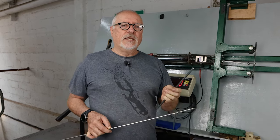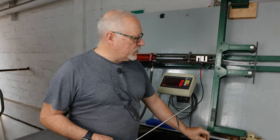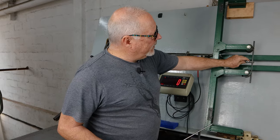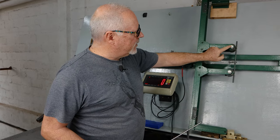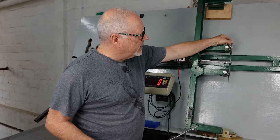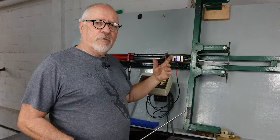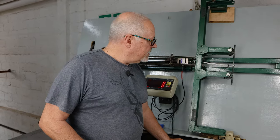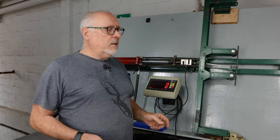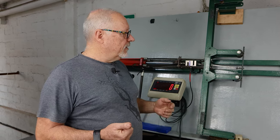What I'm going to demonstrate today is just how much force is needed to bend the steel. We've set up a jig — we're going to be pulling directly on the center. It centralizes itself; it's just elastic bands holding it in position on rollers to allow me to haul on it. Those dimensions will be the same for each test. At the moment I've got a piece of 8mm non-stainless in position. I've already hauled on it to 110 kilos and I'm going to take it up to 120, going up in 10 kilo increments.